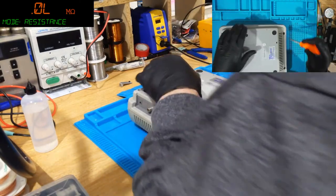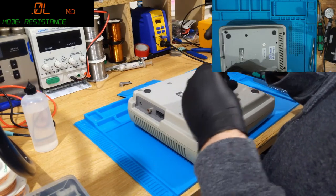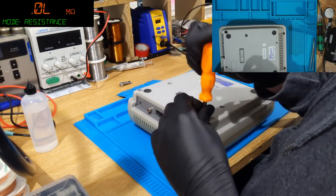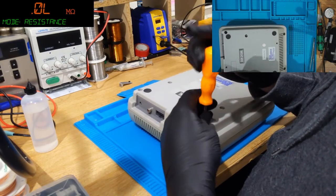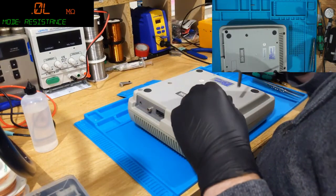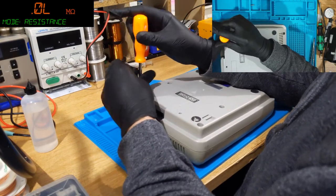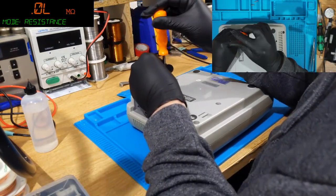SNESes are the absolute worst consoles to diagnose as well. They are an absolute terror. Because what happens is they end up with subtle CPU failures sometimes, where the CPU kind of works but kind of doesn't. And you'll get a black screen and you'll be looking around the board for faults. You'll be checking for shorts to ground, looking for components getting too hot, and you won't have a short to ground. Nothing will be getting hot, so you'll be like, okay, what's the issue then? Has something gone open line? Are the caps bad? And you can switch out all the caps and test each individual component, and the whole thing will be hunky-dory. It'll be like, no, I'm an okay SNES in 100% good, healthy condition, but it's not.